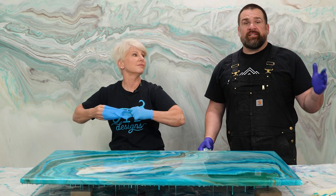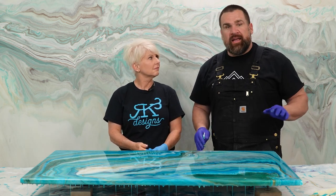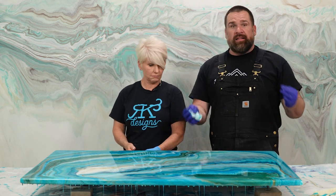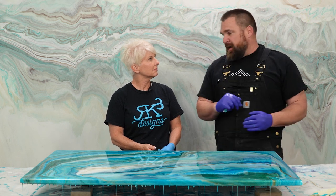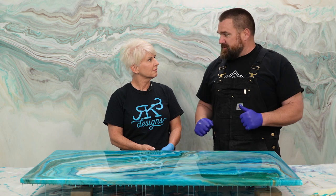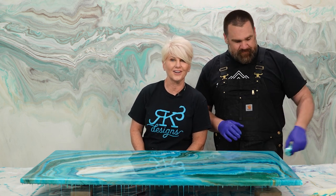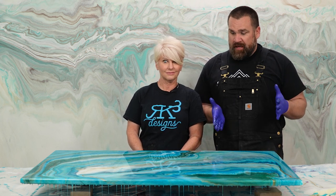All right. If this was a customer's job, I'd let this cure overnight. I'd come back, lightly sand, and apply a clear coat of epoxy, 3 ounces per square foot. Let that cure overnight, come back the next day and apply either the glossy or matte version of the ultimate top coat. Let that cure overnight, and the customer's ready to use the countertops. We're going to have links in the description of this video to both our flood coat video and our ultimate top coat video.